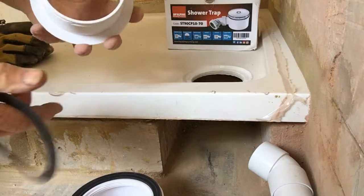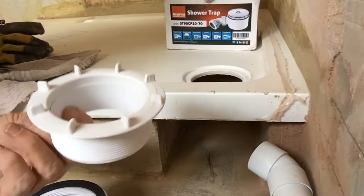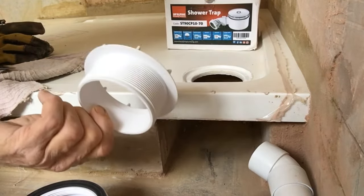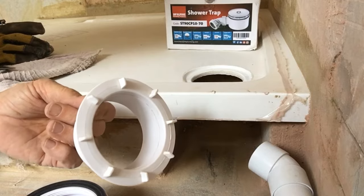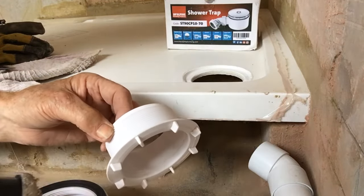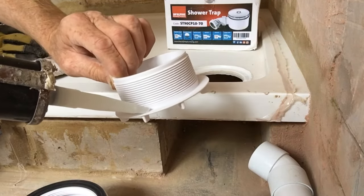This has got a little bit dusty so I'm anxious to make sure everything is as clean as a whistle before we start sticking it together. Some people like to put silicone on the back of this; some people believe that's a bad thing to do. In the olden days we would put plumber's mate around here with varying degrees of success. But these modern days we have a thing called plumber's gold - it's not strictly silicone, it's meant to work happily with rubber. I'm only going to put the thinnest amount on there.